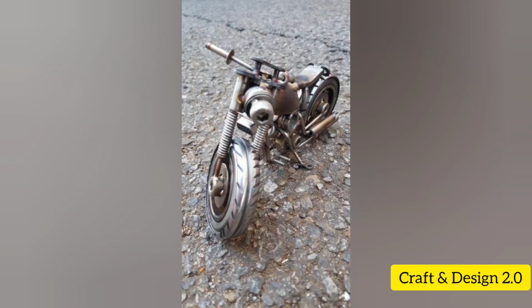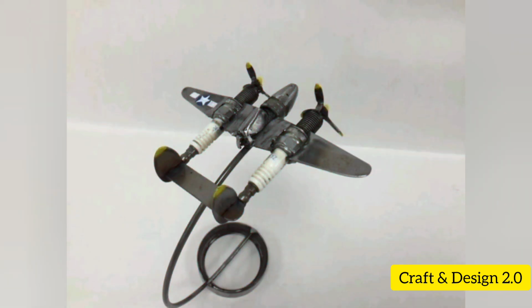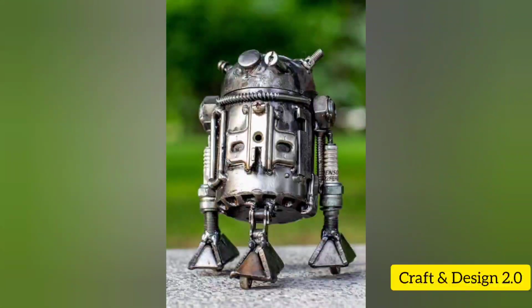Third, control your travel speed. Moving too fast can lead to weak, incomplete welds, while moving too slow can cause excessive heat buildup. Maintain a steady hand and consistent speed.